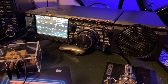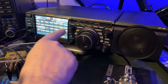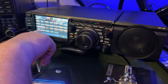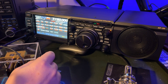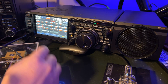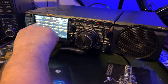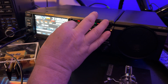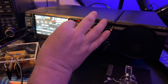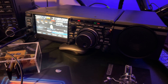What I'm hearing in the headphones right now is very distorted, and I'm running monitor level at 42, which is what I typically use for sideband. Obviously, this mic gain of 40 is going to be too much. Let me lower that — for N4HNH testing. It's clearing up at about 15. One, two, one, two.